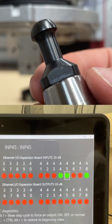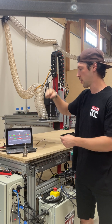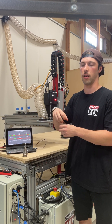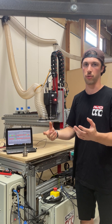So when I put the correctly set up tool holder in my spindle, input 45, which I have connected to the upper position of the drawbar, it's giving me a red signal, which means that the drawbar was not able to fully go into the retracted position — which it shouldn't be able to under a successful tool change.